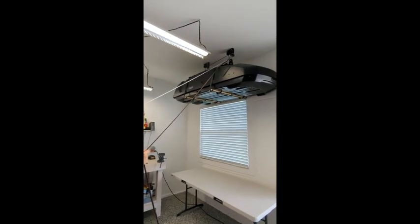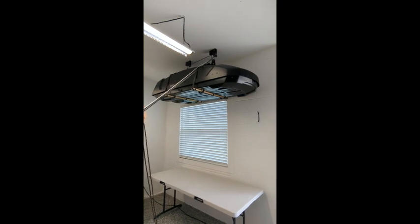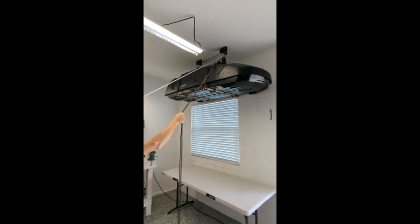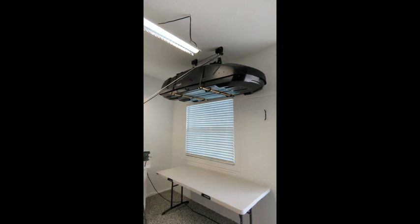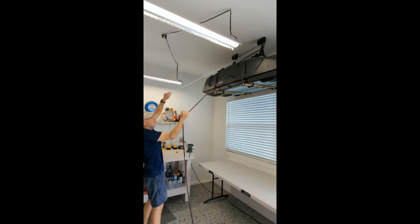So I can hold the brake open. The way you operate this is: you still release the brake with your hoist lines, but you hold it open with this hold line and then lower down. Let me show you — I come over and I pull my hoist line, which releases the brake, and I hold the brake with this hold line.